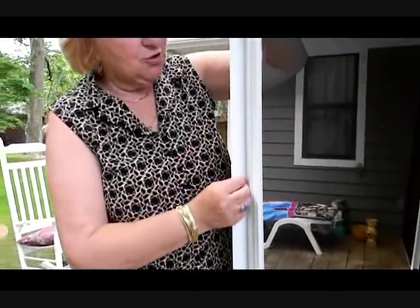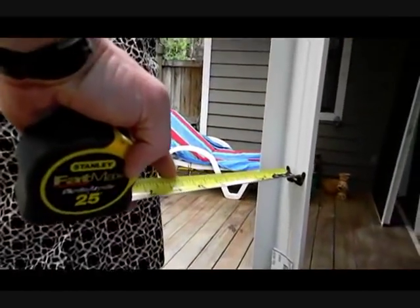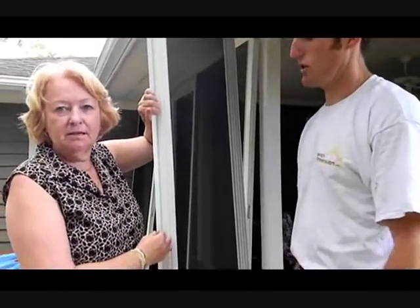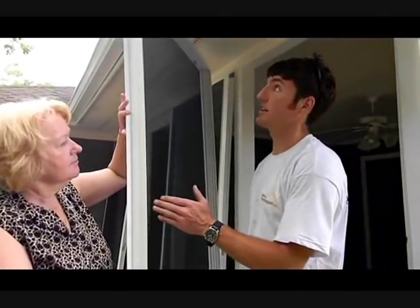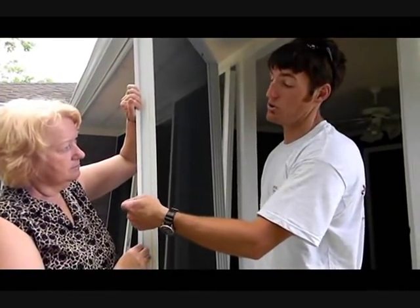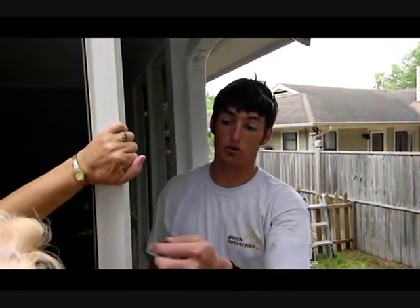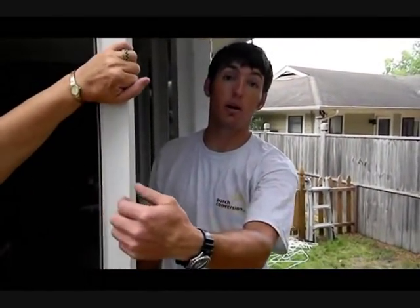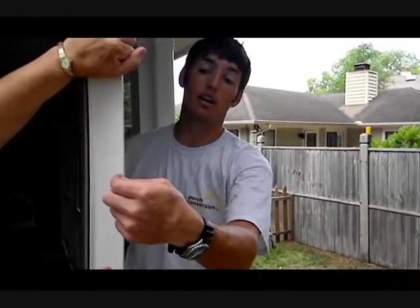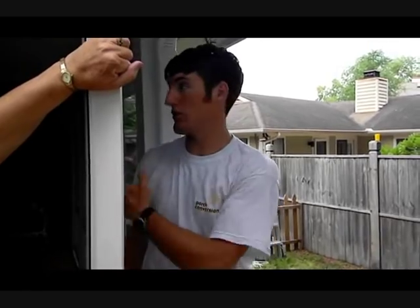This is the flange that you are going to attach to your wood. The flange measures roughly 7/8 of an inch, so you do have some play. Because of the way these things are ordered, it is wise — when you drill your hole to set your window — to drill it towards the outside of the flange, because the units are going to come out a quarter inch smaller than your hole. If you drill way on the inside and run a screw in there, you might miss your framing. So at the very least, you want to hit that outside groove or go center between that outside groove and the edge of your flange to ensure you are going to hit the framing.